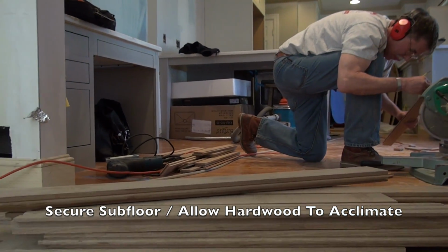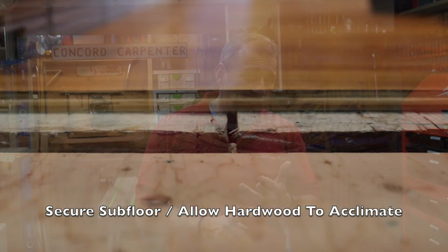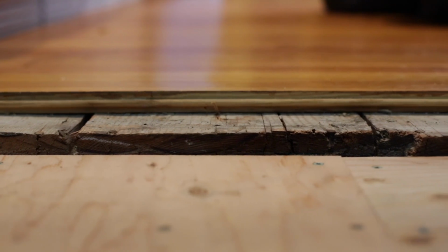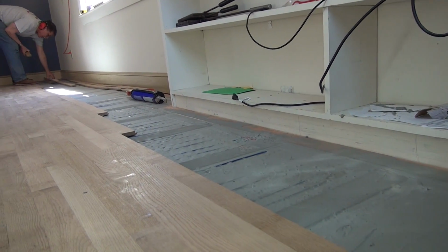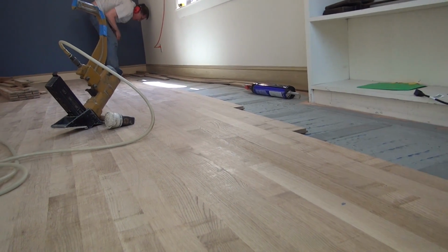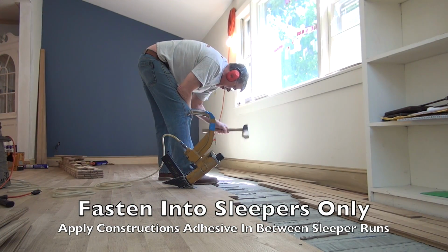Your final installation is only as good as the subfloor that you're installing on. So carefully inspect the subfloor and fix any problems that are going to affect your installation. I like to add screws to an existing subfloor and screw it back down into the joists, regardless of how well it's installed, just to eliminate any loose floorboard squeaks and potential problems. When you're installing hardwood flooring, you install it basically the same way, with or without radiant heat, using all the same precautions.